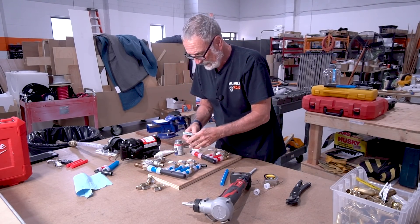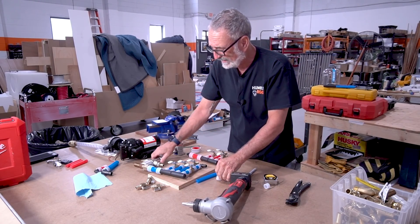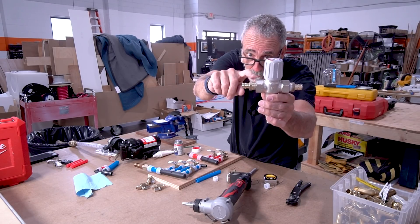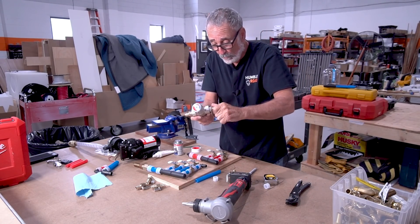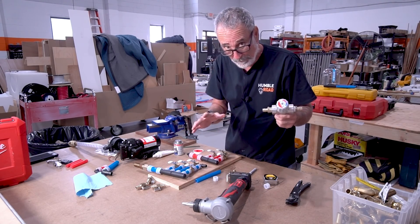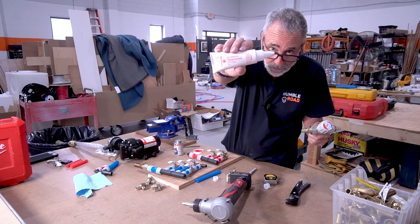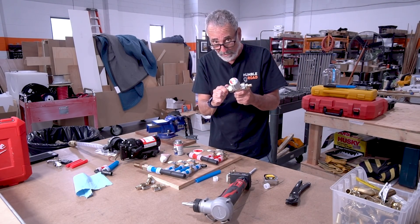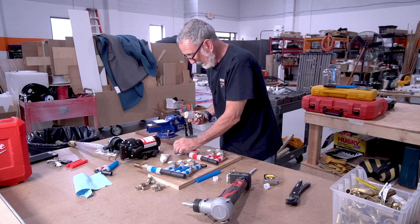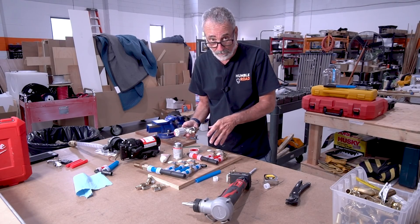So that's Uponor. You don't need anything but the collar and the tubing to make an Uponor connection. Now, these are brass Uponor fittings — brass male MPT on the other end. When you thread those in, I use a combination of things. If it's high heat, like the hot water leg coming into this mixer, I use a high temperature thread sealant, and that takes 72 hours to set. If it's a cold fitting, I use thread tape and then a different type of thread locker. You have to make sure everything you're using is food safe if you're working on the freshwater system.